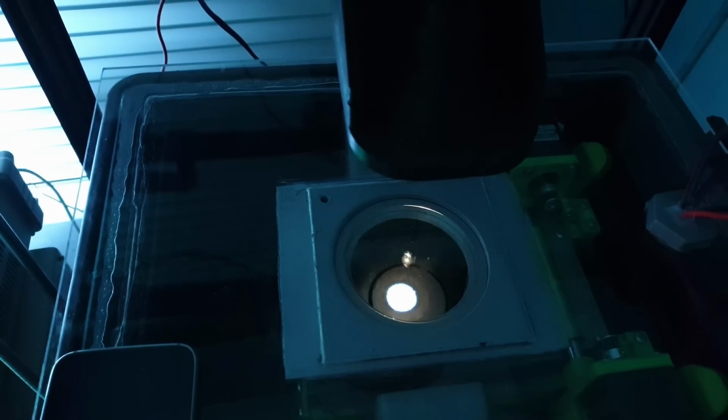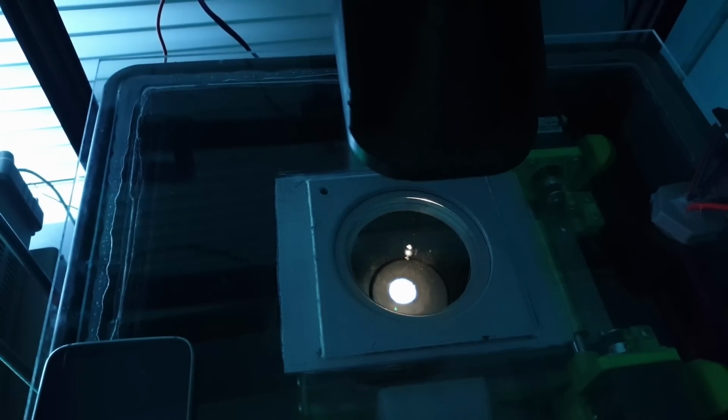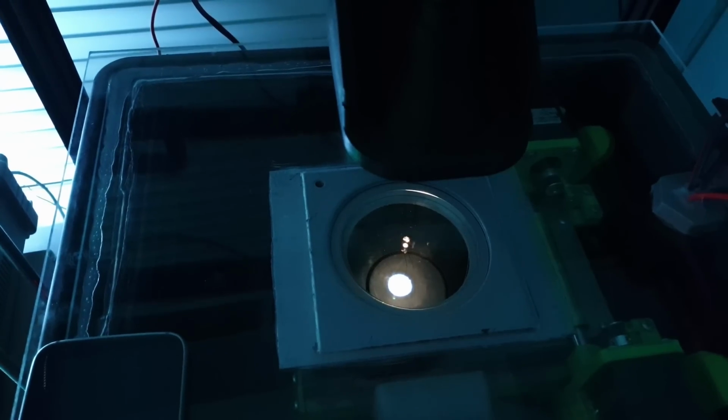And because an aspheric lens uses a relatively aggressive curvature, a lot of that light is just being focused around the focal spot. In the past, I've used a biconvex lens to do this and it's worked fine, but unfortunately in this scenario it isn't going to work. So therefore I would have to resort to using a multi-element system.